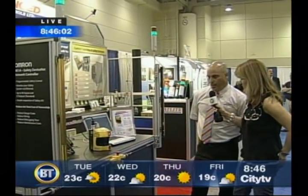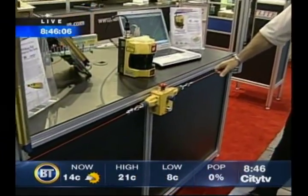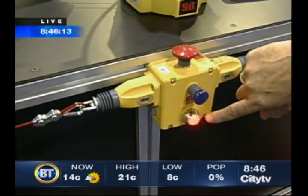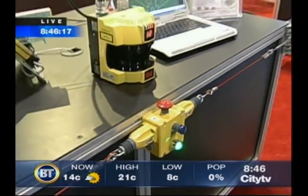Okay, Mark, sometimes I walk around and I'm completely in a daze and I don't pay attention to things. I'm not going to look at the lights, red, green. I'm just going to go right through. So what are you going to do for me? Okay, well, if I saw you doing that, I might actually take a safety pull switch and pull it before you made it there, because I recognize that you were actually disoriented at the time. That same red light that's signaling would signal the machine and stop everything from rolling. So now I'm really in trouble, because now I've stopped the machines from rolling. That's right. But I'm still walking in there.